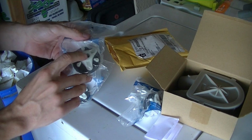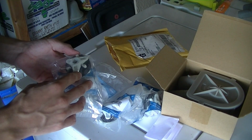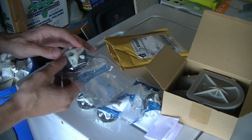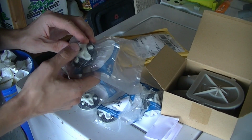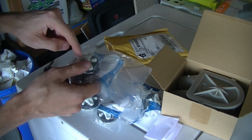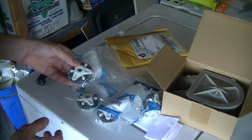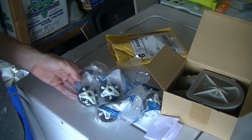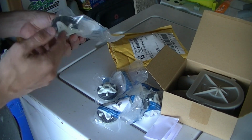And these are the non-metal reinforced ones, which, to me, I kind of think they're a fail-safe for the transmission, so they don't really need to be metal reinforced. In some rare cases too, I've seen, like on the XJ81X's Kenmore, the metal reinforcement ring actually rounded out the shaft of the insert of the metal on the coupler, but it also rounded out the motor shaft. And if that happens, then that means both a new coupler and a new motor are in order.